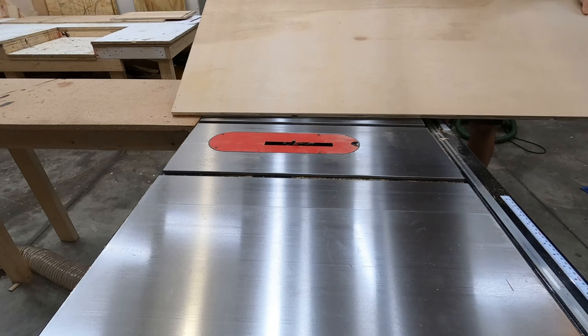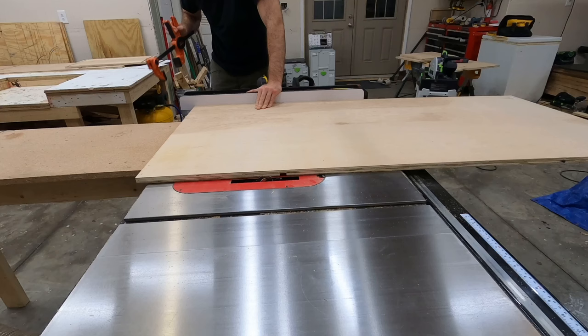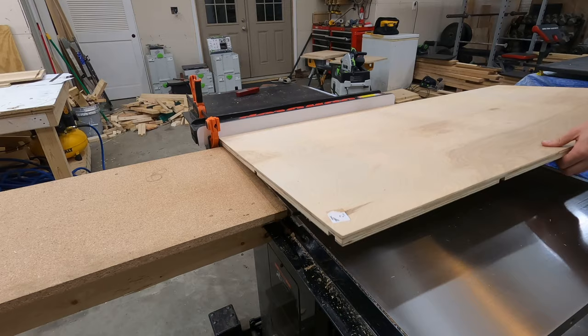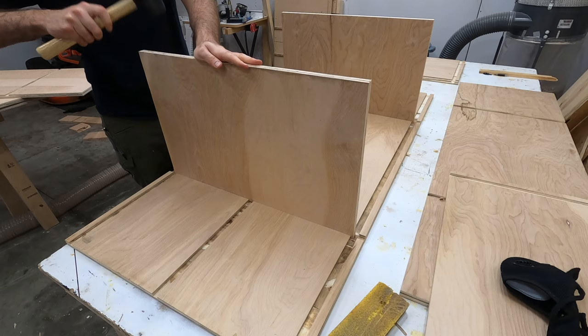The boards I laid out will resemble approximately where I want the shelves to go. But because the shelves are not all in the same spot, I can't just run the full panel across the dado blade — I need that groove to stop halfway. So I mark how far up the panel needs to go, put a clamp on my fence, and sneak right up on where that groove needs to end, leaving the new dado groove just shy of coming to that other groove. I then use hand tools to finish off that groove where I had to stop it shy with the blade.